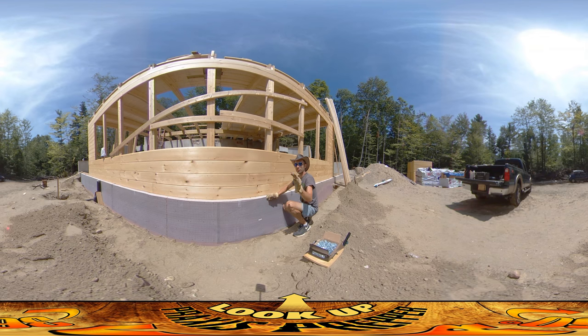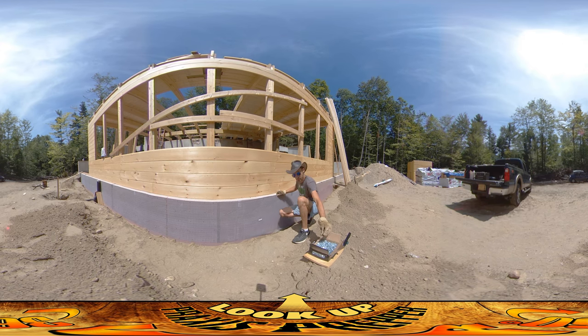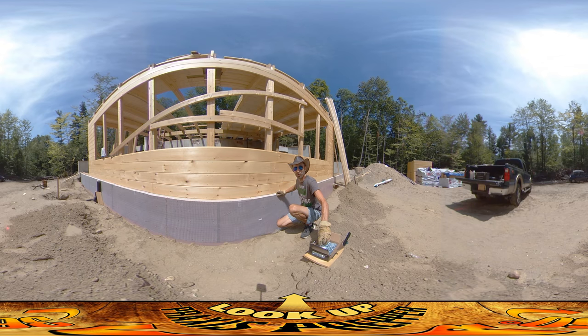The way that I'm putting this on here is I'm taking these roofing nails — about one inch to one and a quarter inch roofing nails. They've got a large head on the back side and I'm sticking them through the wire lath and into the foam at kind of random angles. The idea is that once you put the stucco on the surface these are all going to get rigidized and it's going to be like teeth holding them into the foam. More is better to a degree, but when you get too many it's just unnecessary, so I'm doing one every six inches or so in a random pattern.